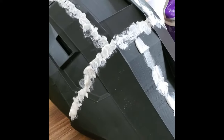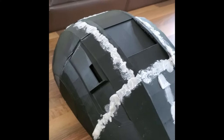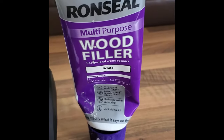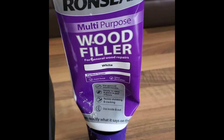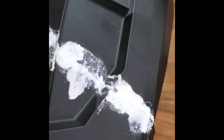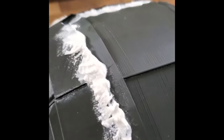A little update on the helmet — it's not been fully assembled yet and parts are still printing, but I have started to fill some of the join lines using just some wood filler. I've used a few brands but I find Ronseal is very good. I'll just splatter it on there making sure the seams are covered as much as I can, and when it's dried — probably give it a day — I'll take it out to the shed and use my electric sander to get it all down.